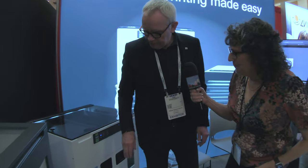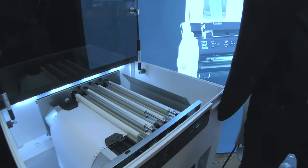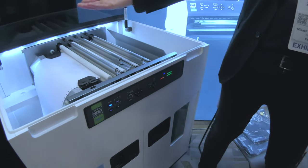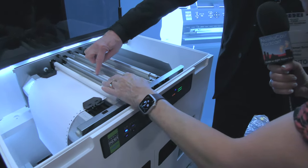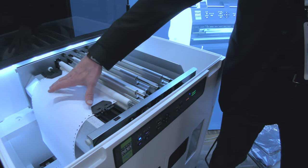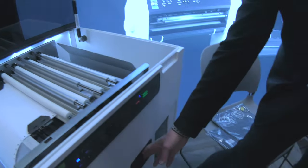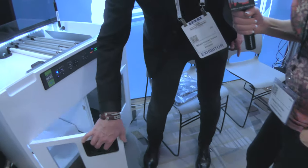And now you've got one more box behind us. Yeah, this is the biggest one. This is also for continuous paper. It looks like a large cooler. Yeah, it is. And it's actually the same technique as you saw in the others, the same embossing head. But this one's got 3 of them, with pickup rollers in between. So you feed in the paper in these tractors, and the paper will be fed through all this printing mechanism, and goes down and falls out, so you can pick the document out here. Okay. So you actually put a whole box of paper here if you want to.